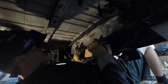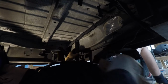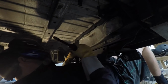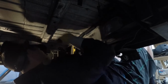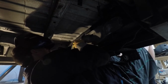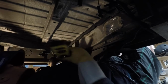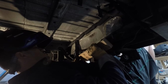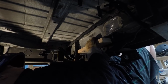Next, I'm going to take the 2x4 here and line it up with a mark I made on the center of the van. The 2x4 is the width that I want the battery rack, and I made a mark on the center of that 2x4, which I then line up with the center mark that I made on the van, so that I know I'm welding the vertical supports exactly where they need to be, and it makes it a lot easier making sure they're the exact distance apart when I have both supports on. So that was just a little trick that I used to try to make my life easier, and I'll leave the video running so that you can see the process of welding all 6 supports on.